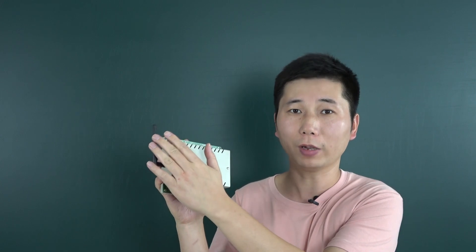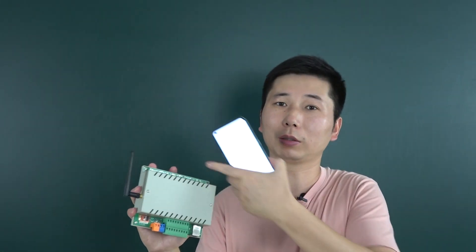You can also see we have a Wi-Fi antenna. The Wi-Fi antenna is used by the 2VR application, and the Ethernet works for Home Assistant via MQTT. So you can use the 2VR application and the Home Assistant application at the same time, because Wi-Fi and Ethernet can work simultaneously. If you are outside your home anywhere, you can use your mobile phone with the 2VR application to control the 16-channel output. And if you're at home, you can use Home Assistant to work locally.